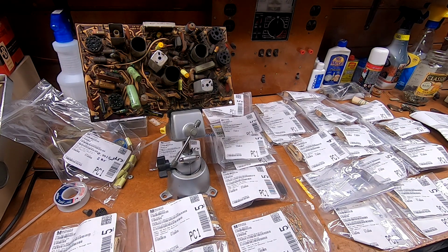The problem is the resistors. They're all half watt or larger, and my collection of half-watt resistors is sorely lacking, and there's a lot of very high-value components that are not super common, like 1.8 megohms or 2.3 or what have you, or 12 megohms. None of the part sets that I have go above 10. I can't even measure above 10 with most of my meters.